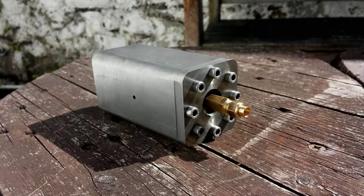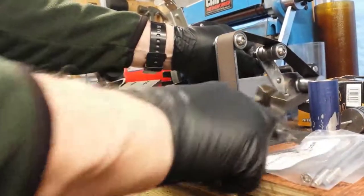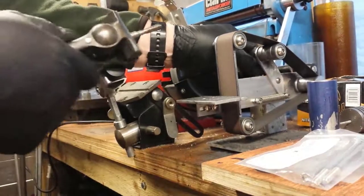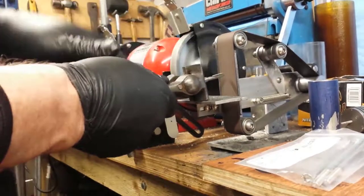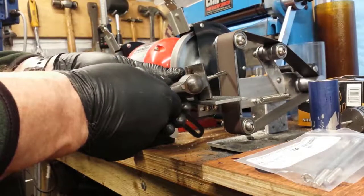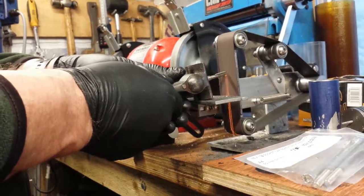There is the cylinder with the cap finished and the valve in situ. You'll see the exhaust port on one side of the cylinder — there's another one the same on the other side. I then wanted to make tapped blind holes in the outside of the cylinder wall to fix the lateral support bars which will anchor the cylinder into the frame.